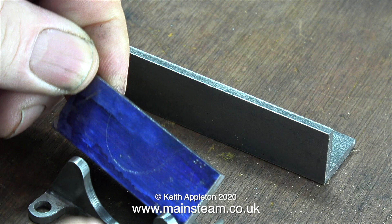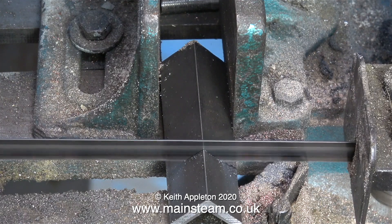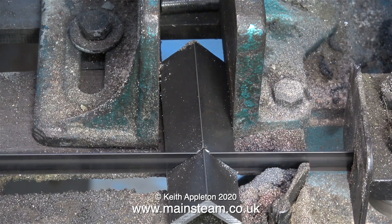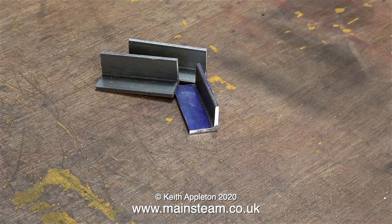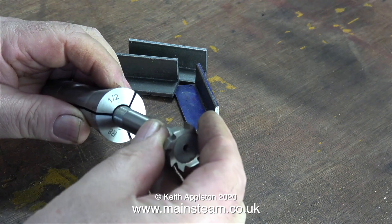I need to make two of these, so I'll take this opportunity to chop up some steel. I'm using my old bandsaw and in no time I have another blank for the second cylinder mounting bracket. Note the steel bolt at the back of the vice — this is just for packing to allow me to clamp the angle using the swiveling jaw of the vice. This angle is the same size as what was supplied with the casting set but is slightly better quality and doesn't have rounded edges. Now I have three pieces of steel angle — I only need two, but I'm taking no chances if I foul up again.